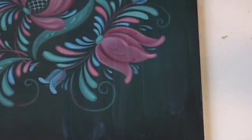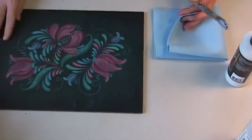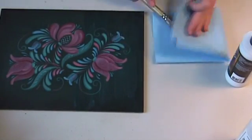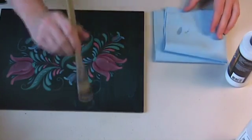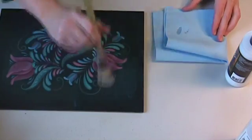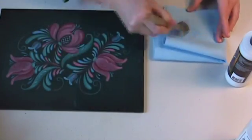I did this on a Debbie Cole piece that I did one time. It turned out gorgeous. And I thought they'd settle. I thought these ridges would just, you know, flatten out. And, no. So what I would do, let me back you up a little bit. Okay, what I would do is I would take my varnishing brush and I would wipe it out in my varnish. Just wiping that off on there. And I go back into my varnish and continue smoothing, wiping off as I continued.